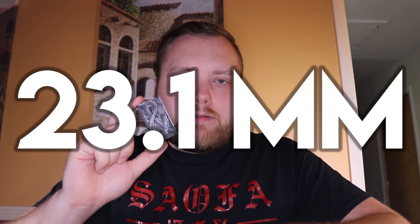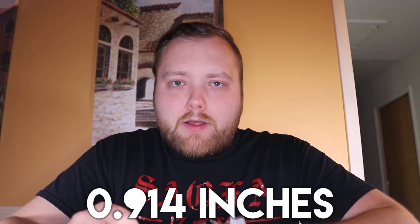So the accuracy range I can achieve without changing my layer height — which would drastically increase print time — is about plus or minus 0.1mm. Since I prefer minus over plus, the winner is the part designed and printed at a height of 23.1mm, which came in at 23.23mm. That translates to 0.914 inches. Coming in at 0.914 is close enough for me to be happy with.